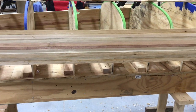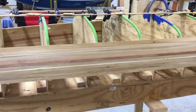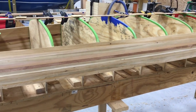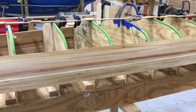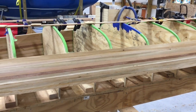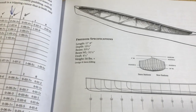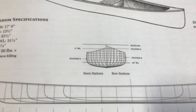Okay, well, so I've had an idea to do sort of a waterline type accent strip, and I'm going to go ahead and use mahogany again. I think it'll look good, and it'll be 5 strips up from where the last one is. And so I thought, well, where approximately is the waterline? So I got back in the plans over here in the book, Canoe Craft, Freedom 17. And we can see the water line on the station diagram,